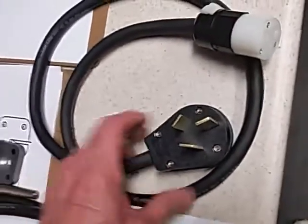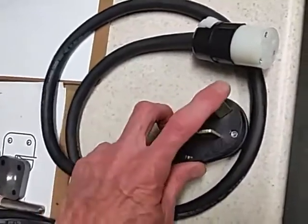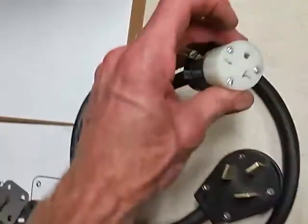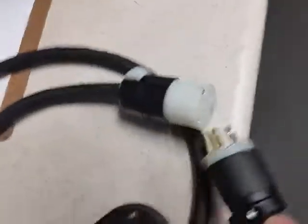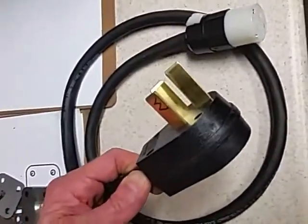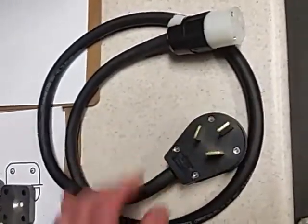Other than that it was pretty easy: find the white wire, connect it to the white wire inside the cord. The green wire goes to the ground, which is the center on both ends, and the remaining wire connects to the last prong. I matched everything up, and now I'm able to plug my car charger into the adapter, plug the adapter in where my clothes dryer goes, and charge my Kia Soul. Thanks for watching.